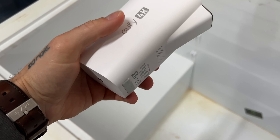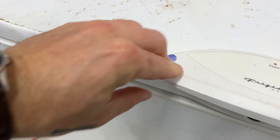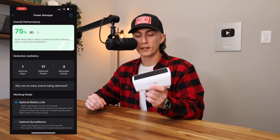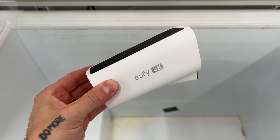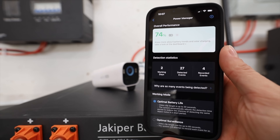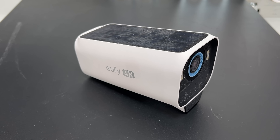Test two — I wanted to see how well this thing performs when it gets cold. We live in a cold climate. In the winter, you can have a week or two that actually gets well below 14 degrees. So we went ahead and threw this thing in the deep freezer, where we've tested tons of our other products — and 99% of them just self-protect, turn off, and don't do anything. The deep freezer is significantly colder than 14 degrees. We put this camera in there at about 75% — it dropped to 74 almost instantly, but I think it was just about to do that anyway. We left it in there for 24 hours and it never dropped another percent. It stayed at 74% the whole time, and when I pulled it out it was still recording and working perfectly fine.